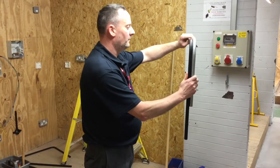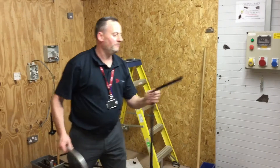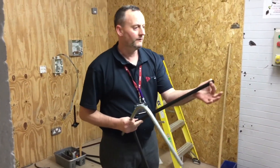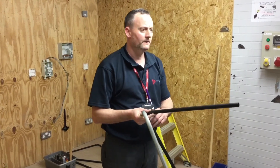We've matched the bending radius to the standard set for the same size steel conduit from a conduit bending machine. By doing so, we know we've conformed to two and a half times the diameter of the conduit when creating the bending radius, as discussed earlier.